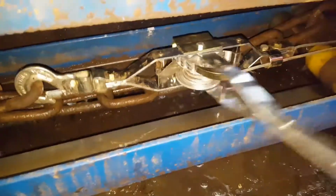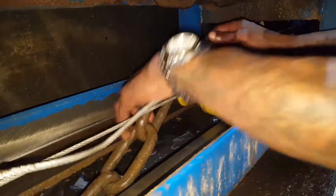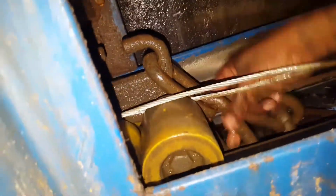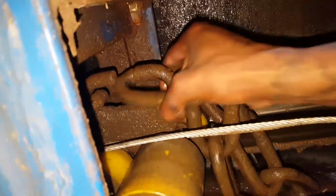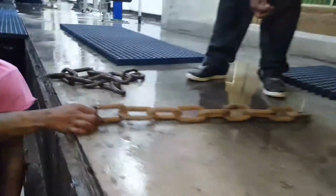Now we come back here and we start putting tension. I'm gonna pause it here for a sec. Okay. So now we're gonna take this 11 link out. That one, right there. You're gonna come over here, take it out on here. Okay. Then we're gonna grab this 9 link in place of the 11 to shorten it. Go ahead, hook it on down there.